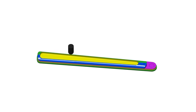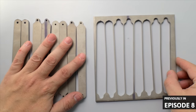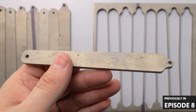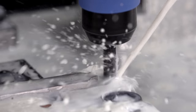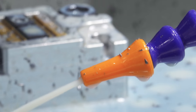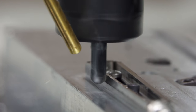But maybe that's offset by the fact that I should probably get blanks waterjet cut. The drilling technique for the slots worked great, but if I do waterjet, I could also get the slots roughed out and save time. Seems like coolant and grade 5 titanium made a much bigger difference than what tools or speeds and feeds I used. I also learned that filming with coolant isn't as bad as I thought, but I'll still probably switch back to air for lots of projects.